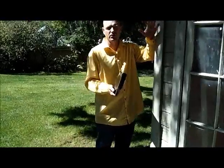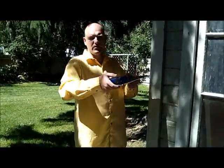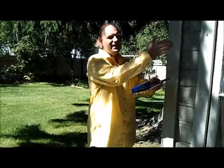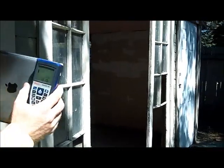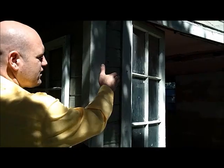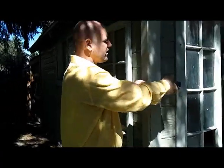The other nice thing you can do — and this particularly works well in garages when the garage door is open — is use the Pythagorean theorem, A squared plus B squared equals C squared. You can go to the inside of the garage at a diagonal from the side and get the exact same measurement as going to the edge. So when the garage door is open, I can just shoot to the inside of the garage without trying to find the edge of the siding.